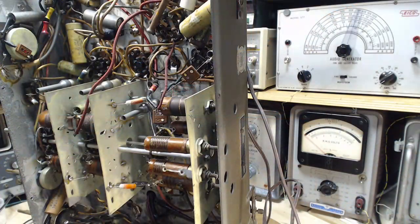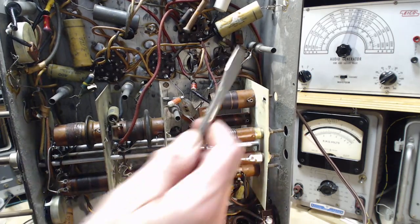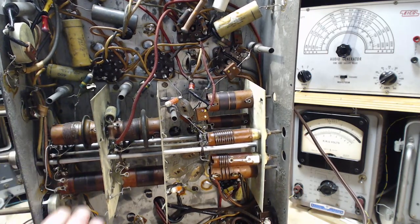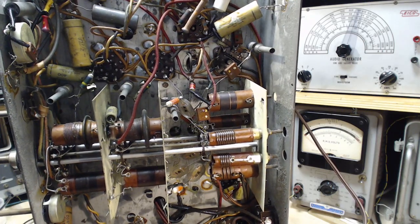Not sure what I would see. Oh, a little bang on that coil there. Now when I look with my eye at what's actually down here, of course on these coils, the facing outward side of them is capable of being hit with a tool, or a soldering iron strike, these top ones are kind of right out there. So it's worth looking at them, especially if you start having trouble, seeing if that's happened.